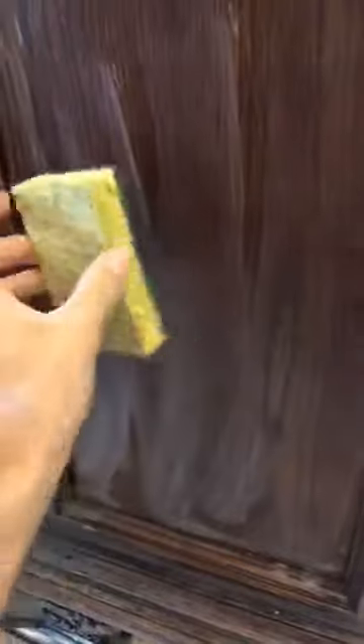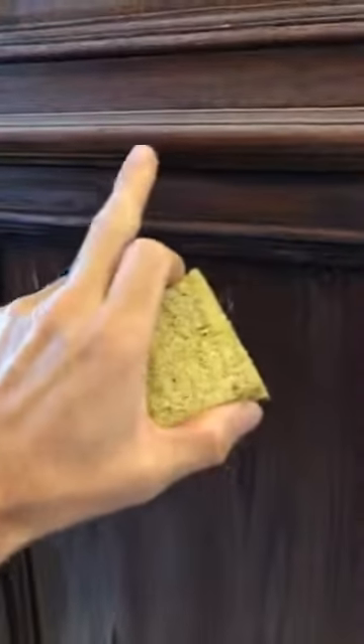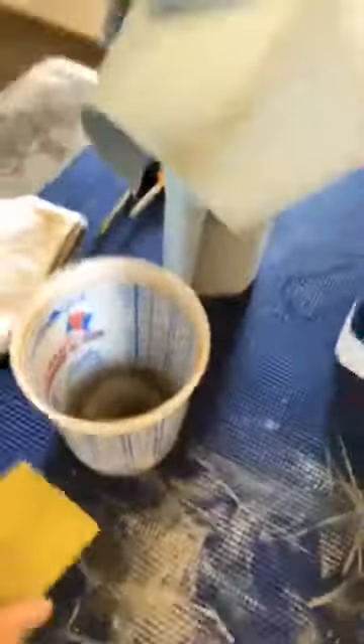I get the piece initially wet with the soft side of the pad, then take the scratchy side and scuff it and clean it. If there are paint scuffs — like where a piece hit a wall — I'll use the hard side to scratch those off. No matter what the surface is, whether real wood or laminate, I give everything a scuff. From my experience it helps any paint adhere to the surface, no matter what kind of paint.